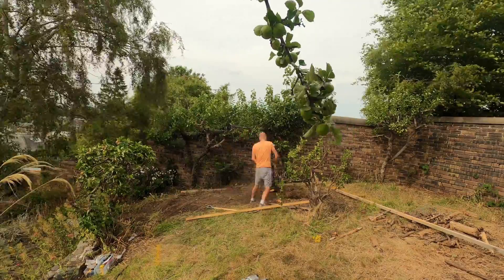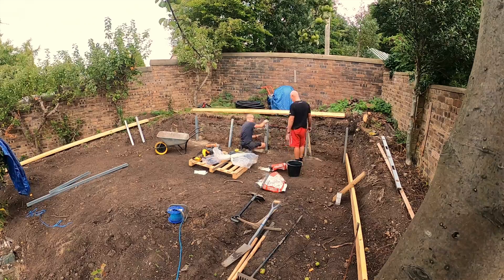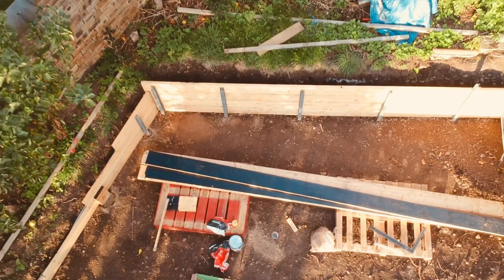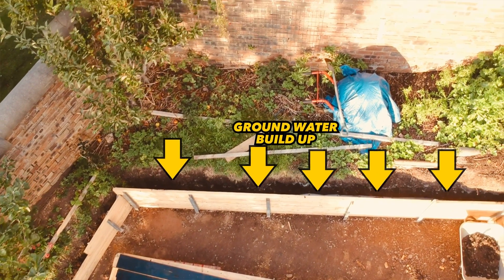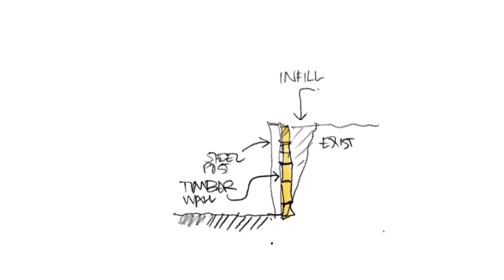I created this flat area of land by digging out and building a retaining wall, but if we leave it there it will fail. Why? Because by building our wall we've created a big barrier which stops the natural course of the water percolating down the slope to find the water table. If we don't do anything we'll have more than a few problems. The groundwater will build up behind the wall creating an additional avoidable pressure on our lovely retaining wall — and sometimes we call this phenomenon hydrostatic pressure.